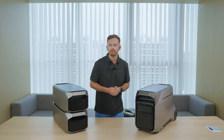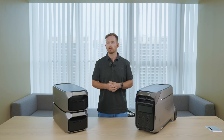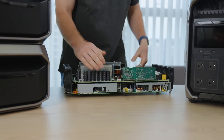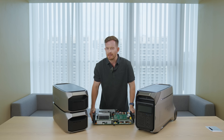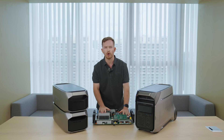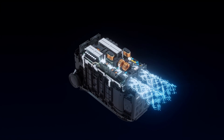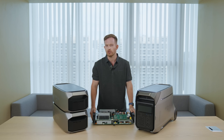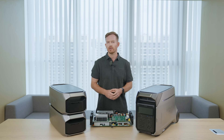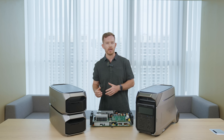How did we pull that off? Let's take a peek at the newly designed internal air structure. We've reorganized and separated high and low temperature components — this part and this part — using dual air duct partitioning for cooling. This setup achieves dynamic airflow distribution. Plus, our advanced algorithm detects temperature changes, allowing the Delta Pro 3 to automatically adjust the speed of incoming and outgoing air based on temperature zones. This optimizes heat dissipation efficiently and quietly.